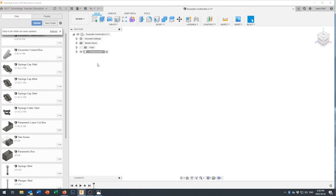A component is where we put our models. As you'll remember from building the syringe, the plunger and the body were two separate components that could interact. Bodies within a component stay fixed to each other and are controlled at the component level. You activate a component by clicking the little buttons at the top. I'm going to call this component 'Box Base.'